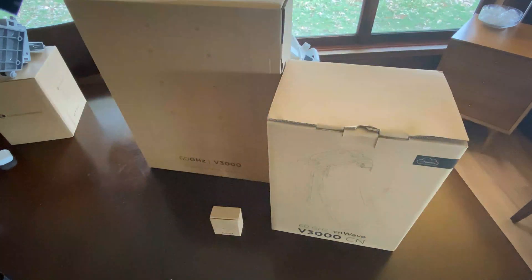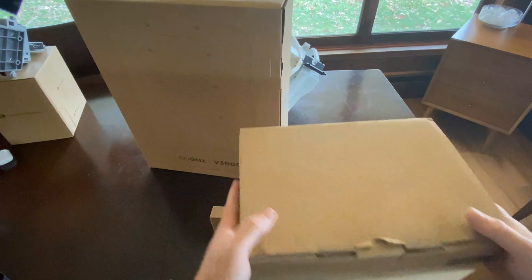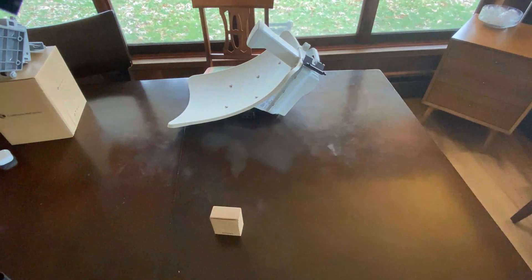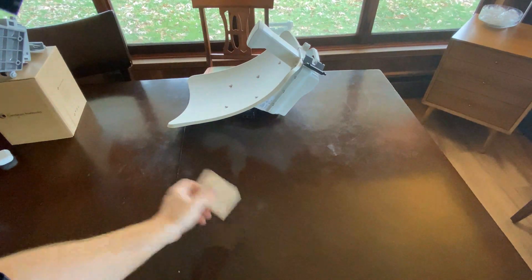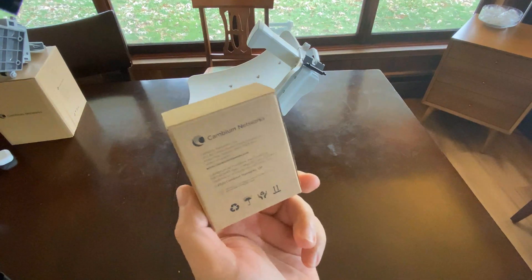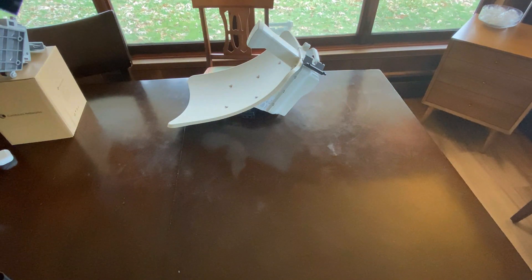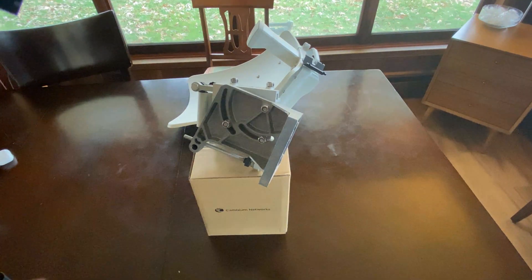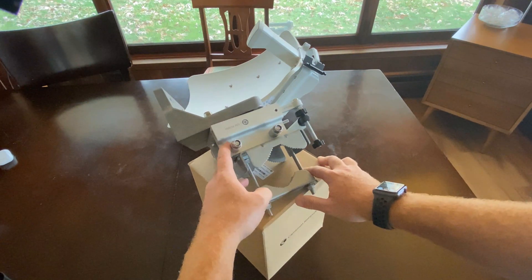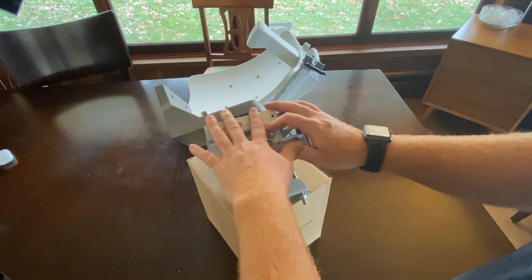Some things that make this unique — it's buried back there. When you order this equipment you have to order the radio, which comes in a pretty large box, and a dish, which comes in an even larger but much lighter box. An optional accessory is the telescope mount: the idea is that at the top of the radio you can put a scope on there and use it to align. I recommend getting one because this is a really narrow radio and it's going to be difficult to align. Another highly recommended optional accessory from Cambium is the precision mount — I'm going to do an entire video just on that mount. There is a less expensive mounting option, and I'll include a link below.